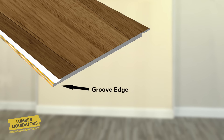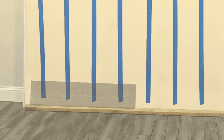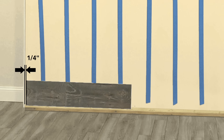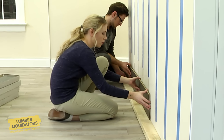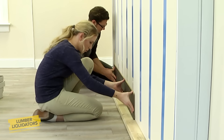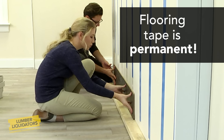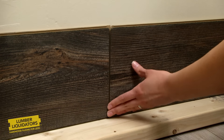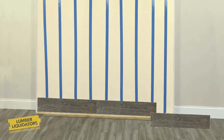Now, identify the groove edge of your first plank, and with the groove edge facing up, place the plank upright on the 2x4, all the way over to the starting edge — in this case, on the left. Leave a ¼ inch gap between the first plank and the end wall. Carefully slide the flooring plank against the wall and push it into the tape. Once the board is pressed against the wall, you will not be able to adjust its position or take it off and try again — this tape is permanent. Do the same with the second board, being careful that the edges of the boards overlap appropriately. Keep going like this until you get close to the end of the row.